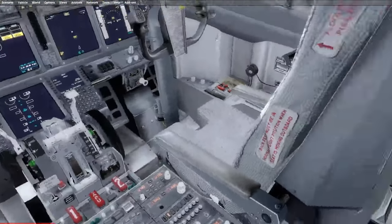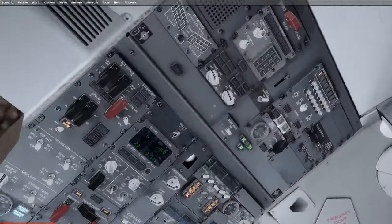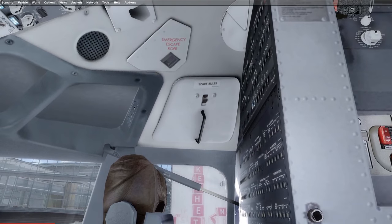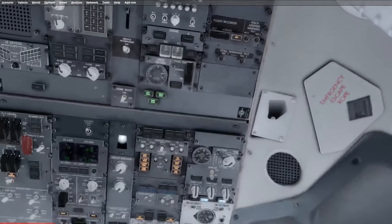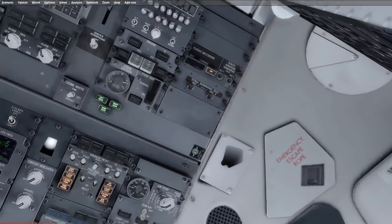After that we can start our pre-flight, which we call a rainbow scan because we're going to move up and down almost like a rainbow. The rainbow scan starts at the bottom where we're going to check all the circuit breakers. This panel is the P6 panel. Then we're going to check the escape rope — we can open up this hatch and make sure not only that the escape rope is there but that it's actually attached to the fuselage. Moving up, we're going to turn on our voice recorder, which is placed here; there is an on and auto button, and we're going to move that to the on position.